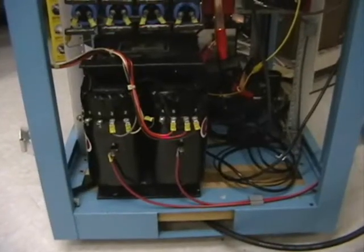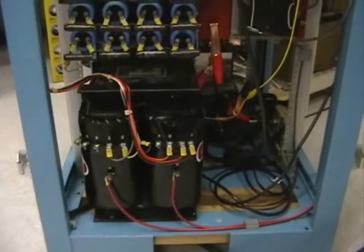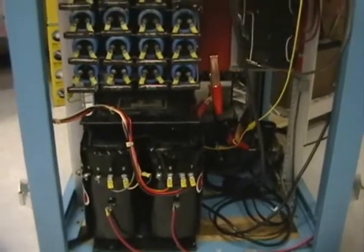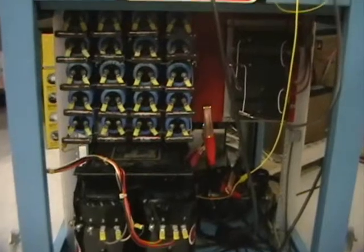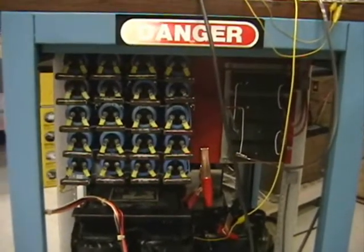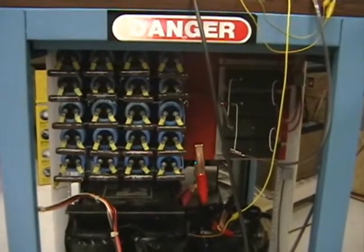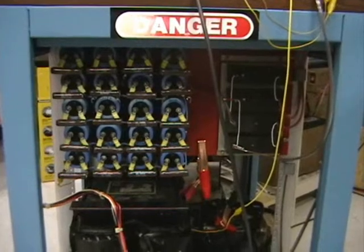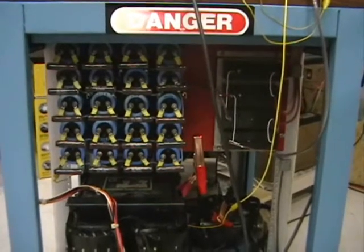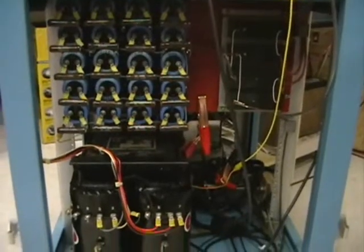The roll-around cabinet contains the power supply. A large plate transformer supplies high voltage for the amplifier system. A bank of filter capacitors and rectifiers handles converting the AC power into up to 3,000 volts DC for the amplifier to function. There are appropriate safety interlocks and control circuits to prevent accidental damage to the amplifier and to provide a certain measure of safety for the operator.